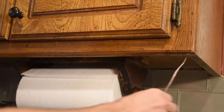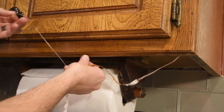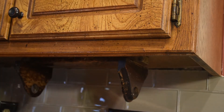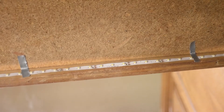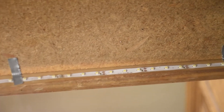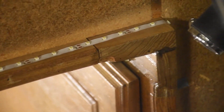The SMD LEDs have a sticky backing but it really doesn't last that long, so it's only good for the first few minutes before you put the staples in. When you peel off the backing and stick them up here, I decided to have these lights point towards the backsplash rather than straight down. I did this so it's easier to turn the corner — that way I didn't have to cut the strip and then reconnect the wires. It can just fold around the interior corners of the cabinets.